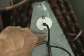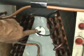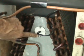That's what the instructions tell you as well. Now I need to fasten the mount onto the side of this coil. I use two self-tapping 5/16 screws to fasten the porcelain onto the side of my A-coil. When you fasten the light into position, the porcelain mount could easily crack, so do not tighten the screws on the mount very hard at all, or you will crack the porcelain mount.